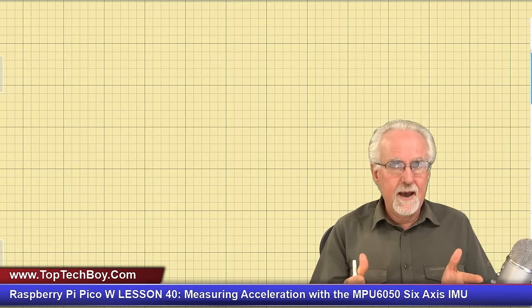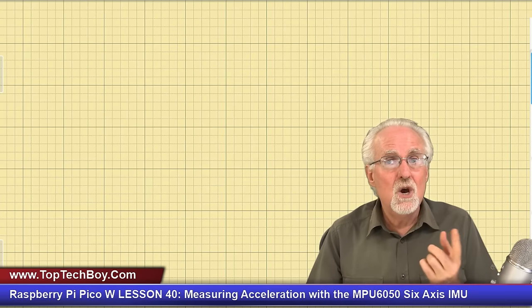What is the foundational concept behind MEMS? It is to use the same manufacturing techniques we use to build integrated circuits, but instead of just building microscopic electrical devices, we also build microscopic mechanical devices. So think of an integrated circuit having transistors — we use that same manufacturing technique but build mechanical devices. We built the world's smallest steam engine, the world's smallest rocket engine, electric motors, transmissions, and positionable mirrors — just about any mechanical object you could imagine in the real world, we could build microscopic versions of it.